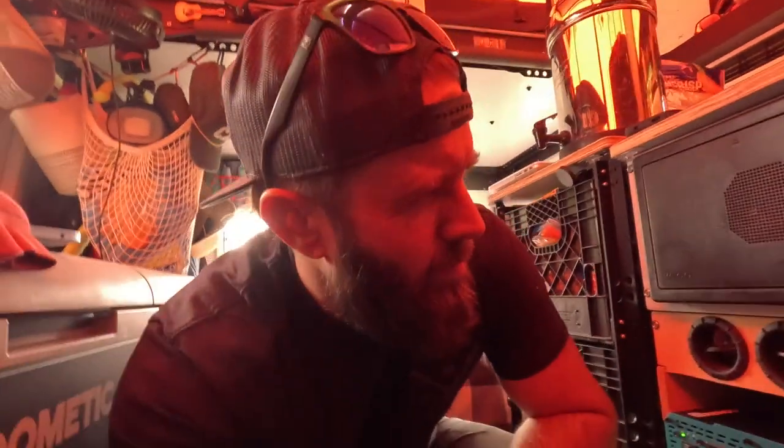I'm going to give it an hour and then we'll see where it's at after an hour and a half total. It's been a total of an hour and a half of the AC system cycling on and off. Every time I've come in it's in its AC cycle, so the pump's on and we're down to 82.2 percent on the battery life, pulling around 48 amps — pretty close to what it was initially — and it's saying 3.4 hours till the batteries go to zero percent. I'm impressed so far.